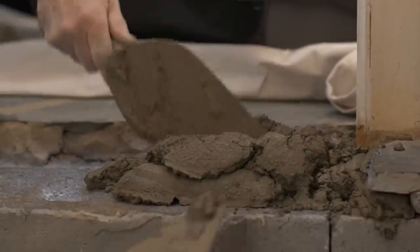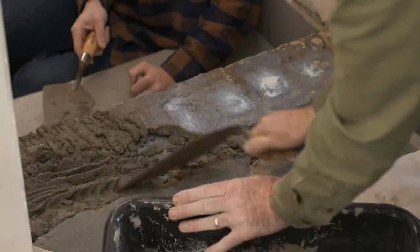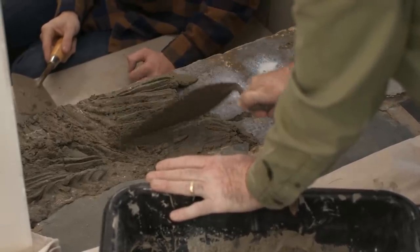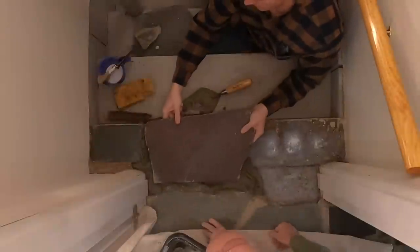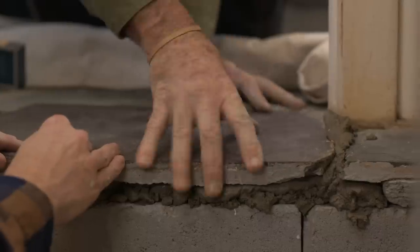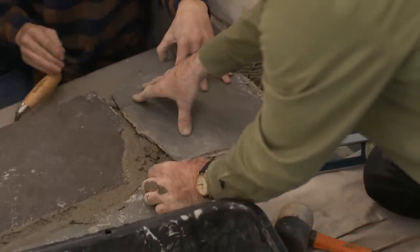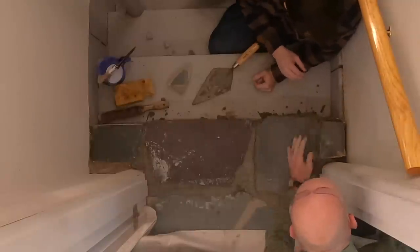Now I'm going to get ready for the bed. All we're looking to do is level this out — we're going to leave it a little higher than the stone needs to be. I'm going to really try to jam it into and under the stone. This mortar is a little stiff, but when you're doing any type of stone work, the material is usually a lot heavier. So the stiffer the mortar, the more strength it has to prop it up as you're working it into place. I'm going to take the stone and wiggle it down into place — just shake it down. You can just imagine the bond that I'm making on the bottom of the stone as I wiggle.